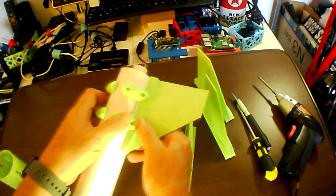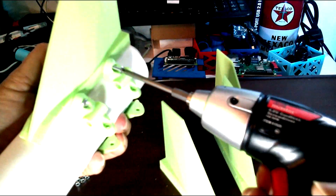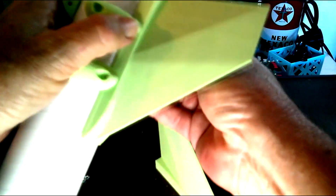I'll get the first fin in there. It's a little difficult jockeying the screws into place in some cases. Later on I figured out you don't want to make each of these tight as you assemble them, because when you get to the last fin, you have to loosen them all up just to get the last fin on. So leave them loose while you're doing this.